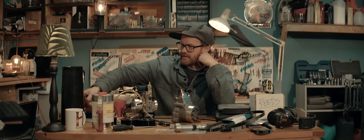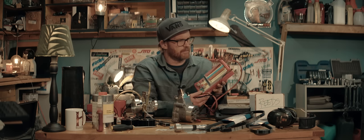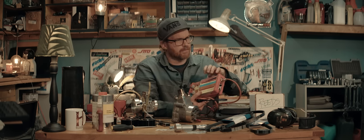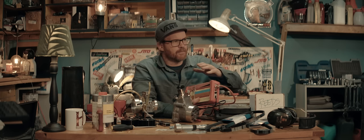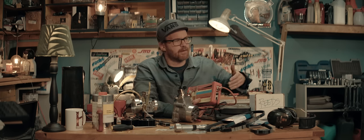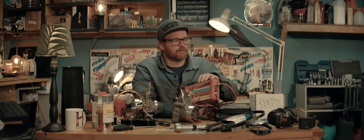So we can't use this. I didn't see any ignition problems while monitoring with this unit. It might be this is just too slow, or my eyes are too slow to see what's going on. Could be that it's dropping spark and thereby the pipe is dropping out of resonance in one cycle. Then the next cycle it won't fire because everything has gone to shit. Then it takes a couple of hundred cycles for it to come back, and then the same thing happens again. Something like that. The spark plug is firing, but the mixture is totally wrong for some reason.